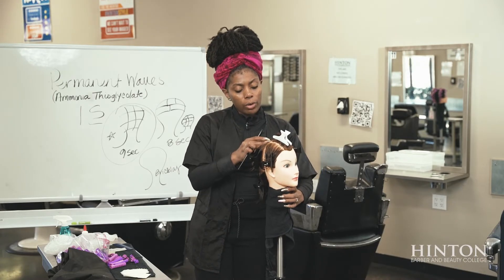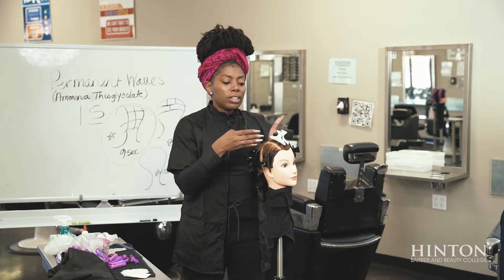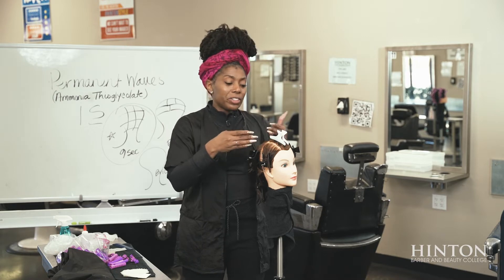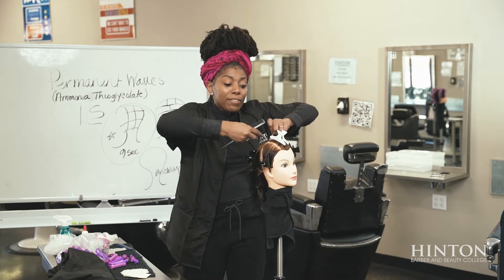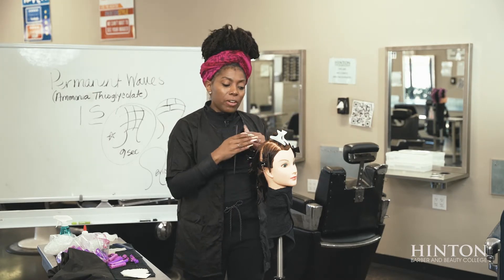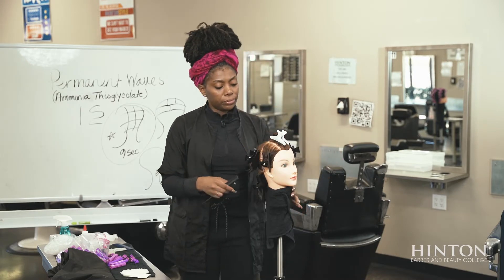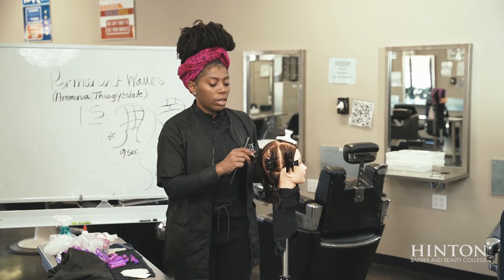Next, we are going to work from the interior in wrapping the rods to the exterior. The reason why you always want to work from the interior to the exterior is because you don't want to block yourself. If you work from the outside first, you might have to force rods into the section. If you work from the interior, you don't have to force rods anywhere — you work in, then out.